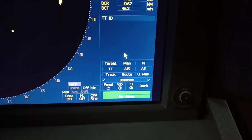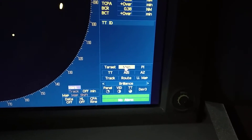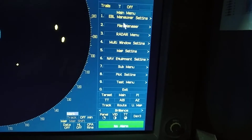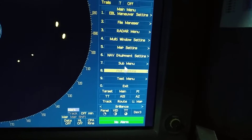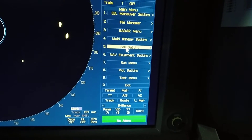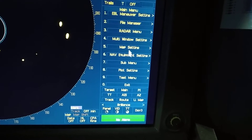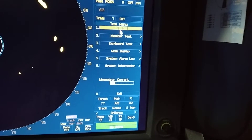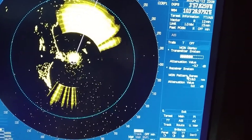As you can see, there are many menus. I will tell you the important ones. First, go into 'Main' — there are many sub-menus. You can explore them for more information. I want to check the radar performance test. The performance monitor is important; you must check it every watch and log it. Go into the 'Test' menu, then select 'Monitor Display'.